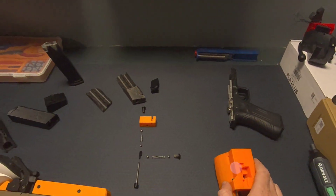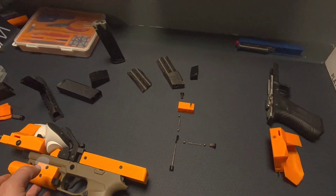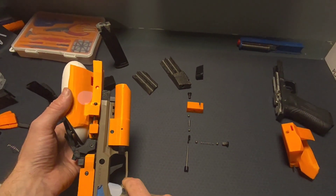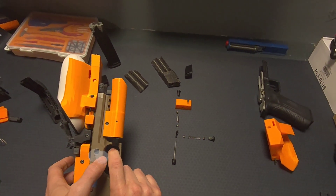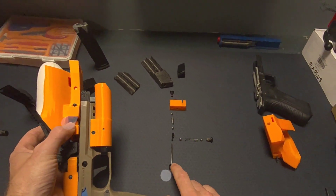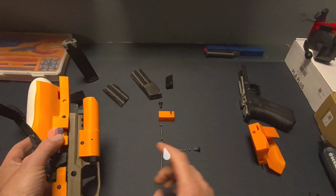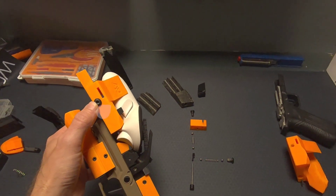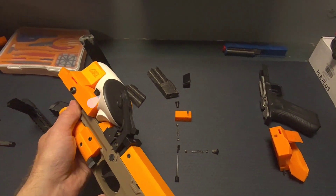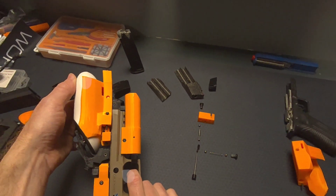Right here is an internal exploded view of what you have inside. As a reference, we're going to take a look at that inside the XR pistol. This trigger has a lever that goes up onto here, and this part runs up against there. The force of the screw on the side pushing in is what determines how heavy the trigger pull is for this break.